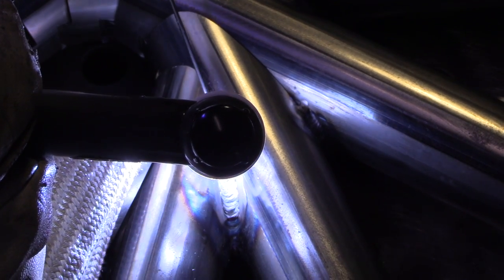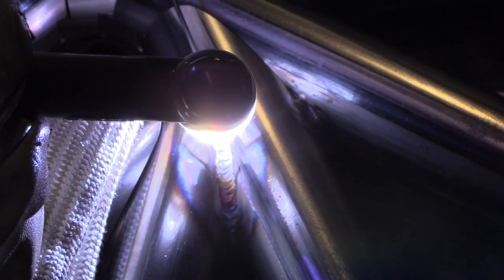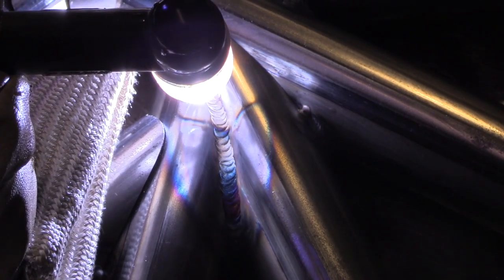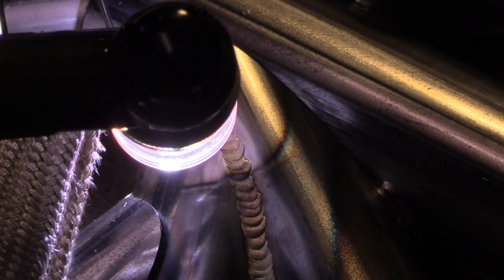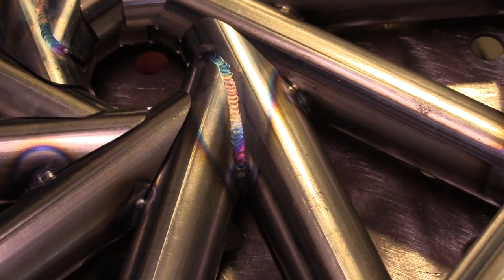Back on the steel hurricane challenge, I'm using a 309 rod for this weld to show the difference in final appearance — it gives a lot more rainbow colors. You'll see this on trophy trucks where the first pass is done with ER70 or ER80S-D2 rod and the second pass is done with 309 or 312 just for the look. This is a single-pass weld on regular cold-rolled steel — there's no real need to use 309, I just did it here for the look.